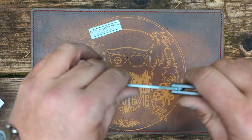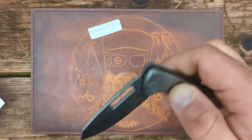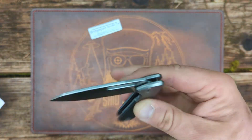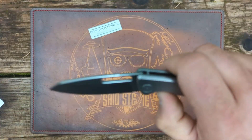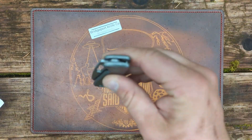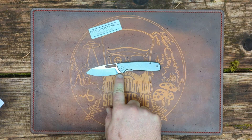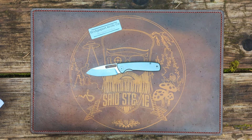The other thing that's going to be addressed is some blade play. I guess there is a little bit there — I haven't tried to tighten down the hardware at all. Maybe some thicker bearings or something. The plunge grind is also going to be pulled back slightly, and a series of letters and numbers will be added to the inside of the liners describing the model, blade steel, and the particular run of the knife.